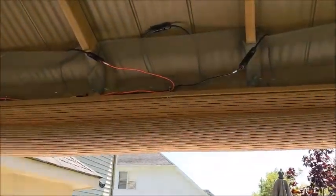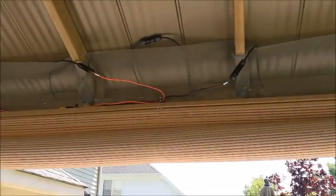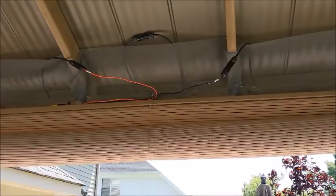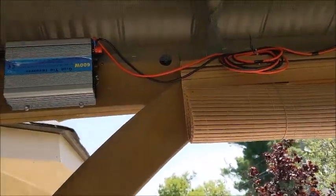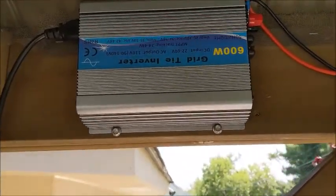You can see I've got them coming in here — they're temporary for now. I haven't wired it up completely, but I've got them in series to increase my voltage, and then I've got it going through about 10 foot of cable. Now that could be my problem — it could be that my cables aren't enough.